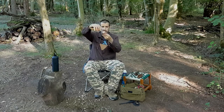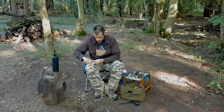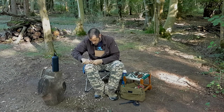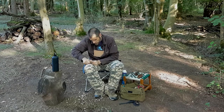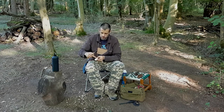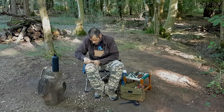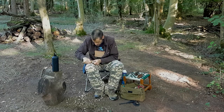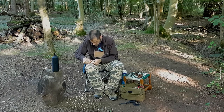So the back of the bowl is good. We've got three distinct facets here now. Because I know I can work from right back here, I'm going to try and come through and take those off a little bit at a time — don't be greedy. Try and work these in the same plane, just taking off an even amount to level up this third facet. One, two, three to the middle — try and make the middle one the same as the outside one. I'm going to take a bit off this side of the middle one, aiming to kind of equalise those. Now what will be five facets is how I like to leave it. I like them to be quite clean so they're comfortable and reasonably even so they look quite nice. But it's all a matter of judgement.